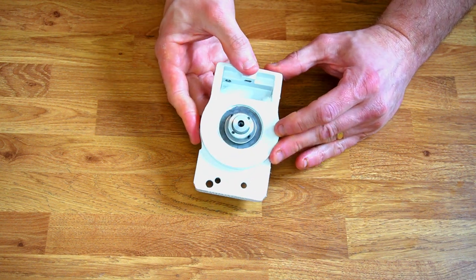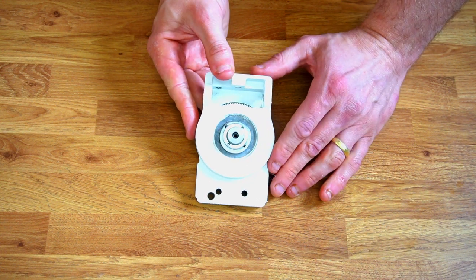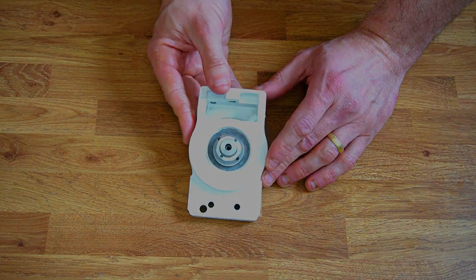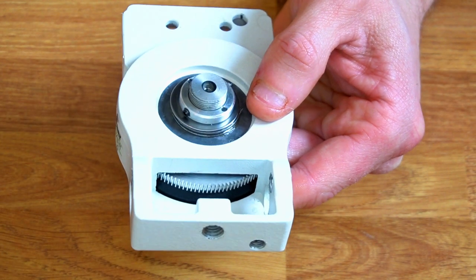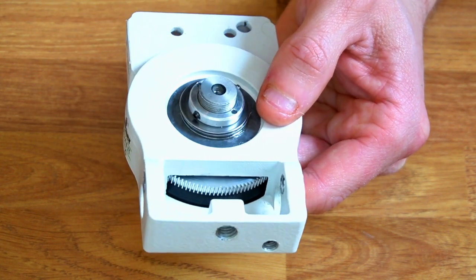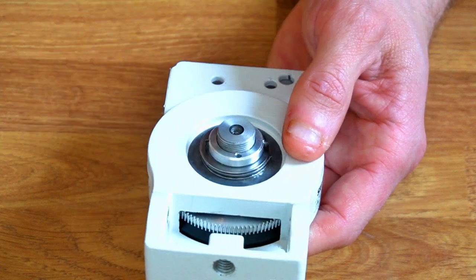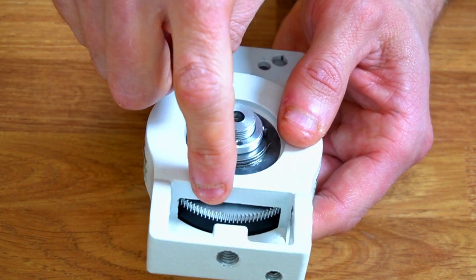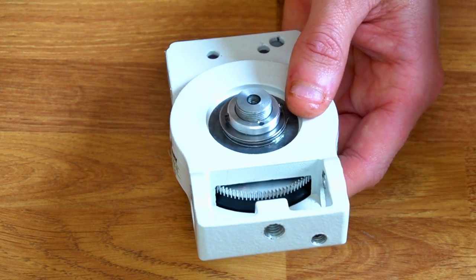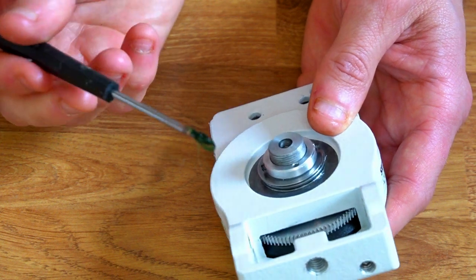Right, so it's on there, we just need to readjust it. So once everything's back together, we'll then do the preload, the adjustment on the bearing. Now with the bearing installed, we've not preloaded it yet, but with the gear wheel now in place, we can lubricate the teeth on that gear wheel using type 1 grease, which is this tacky, green grease,